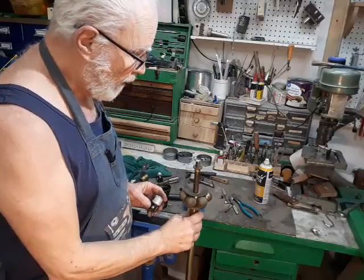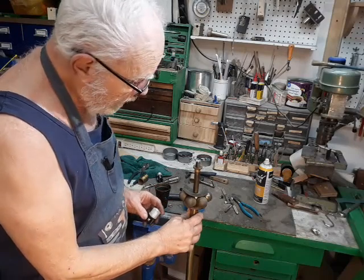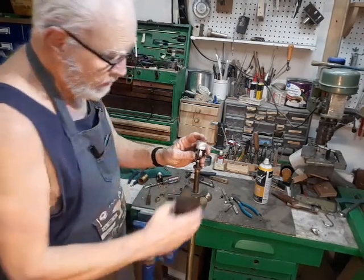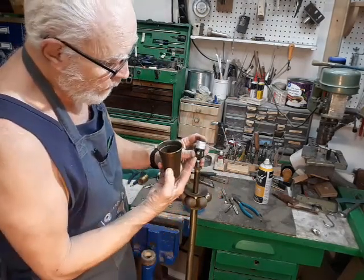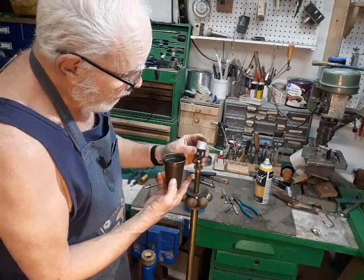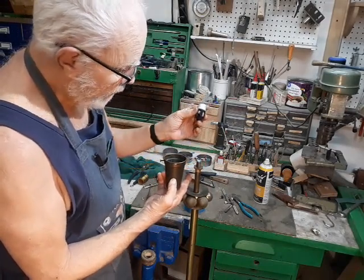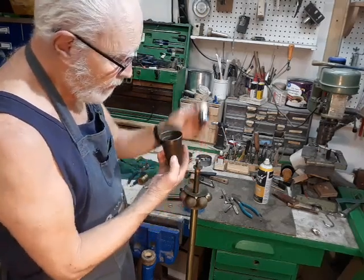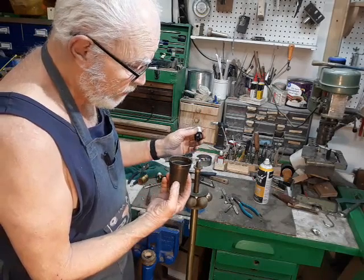Okay, I've got the pole back together and we're back on the floor. Now the reason I'm using a hickey socket for this is because down deep in this cup it's impossible to attach the wires, but the socket comes off the hickey so it can be installed — the wire pulled up through here, attached, and then pulled back down. Very neat way to do this.